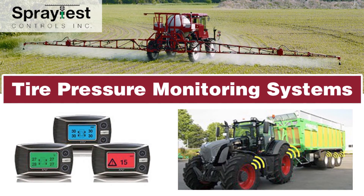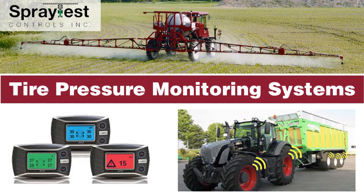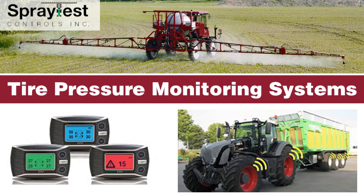We also have a tire pressure monitor system that we're marketing. It's designed for agricultural use, very similar to the sensors you would have in your SUV or pickup truck, except it's designed for agricultural rims. It gives you a live readout in the cab on every tire all the time, so you can see if you've got a tire that's leaking. You can set your minimum pressure, and an alarm will sound and the screen will change colors. Tires are expensive — it's just a tool to help monitor air pressures so your equipment is working the way it should.